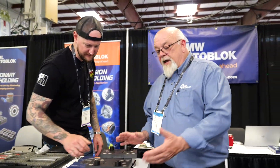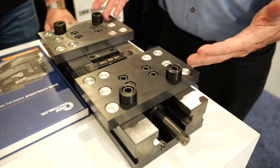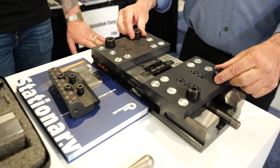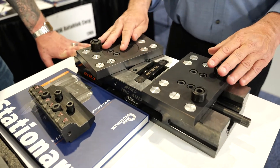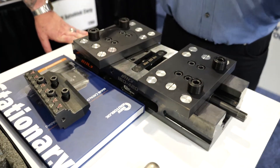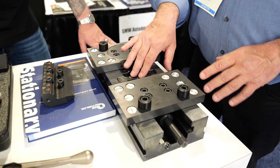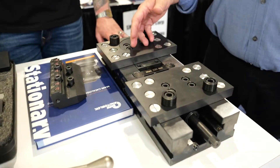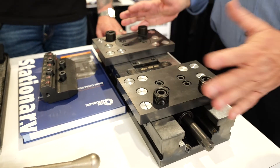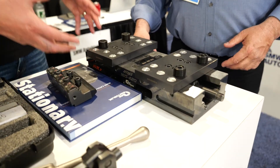This is one of our five-axis vices that has a unique pattern at the top. This is for clamping uneven parts or round parts on a five-axis vise. These jaws actually come with this vise, but these clamping inserts are also an option to buy. You can have a pivoting jaw and a fixed jaw, so you can clamp a round part, a connecting rod, a pump housing, or anything that's a non-conventional shape that a two-jaw clamp can't handle. This can be done with two swiveling, two fixed, one in the middle, double clamp — anything like that, or a round part that comes from the lathe to put holes in it. So now you don't have to change your vise to a chuck to put a round part on your mill, which saves a lot of time and setup time. You can put those same center grips in with this setup, so you're biting it as hard as possible.